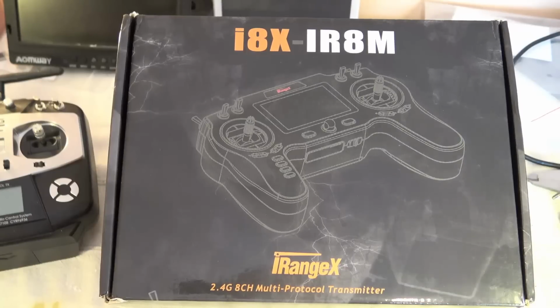Hi, welcome to a new video dedicated to the new universal or quasi-universal radio command. This is the iRangeX IR8M, and it is nothing else than the new more or less cheap radio transmitter, including the 4-in-1 multi-module, so with the 4 main RF chips, in order to support more than 100 different protocols, from toy quadcopters with the NRF2401, up to more advanced professional protocols such as FrSky, FlySky, and Spektrum.